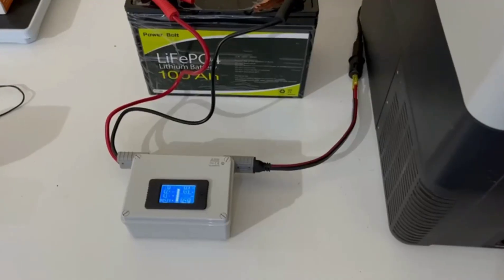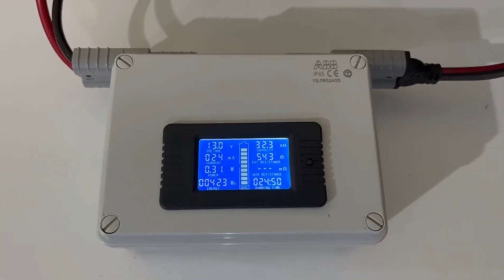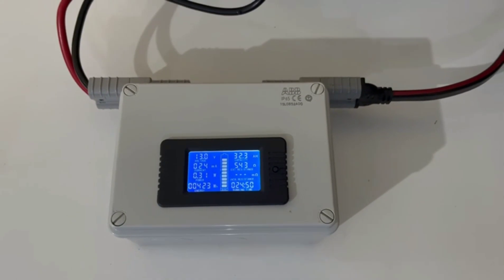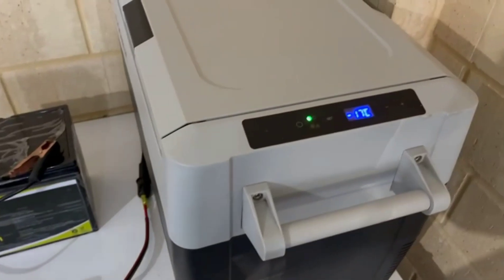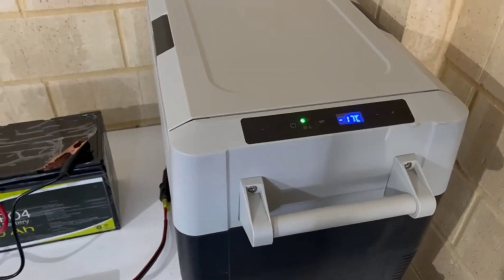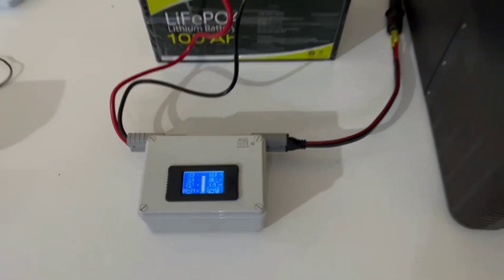It's been just over 24 hours — 24 hours and 50 minutes. We're sitting at 13 volts and capacity-wise we've used 32.3 amp hours. So far so good. We'll just keep doing what we're doing — minus 17 on the freezer — and we're going to keep opening and closing the lid. The compressor just kicked in at 1.5 amps. I'll get back to you in another 24 hours.